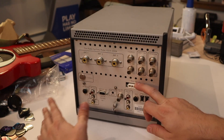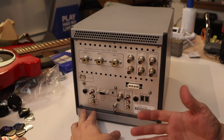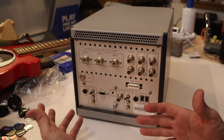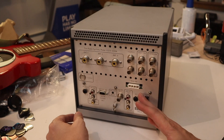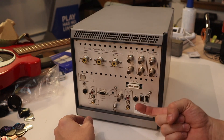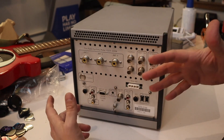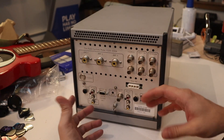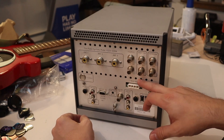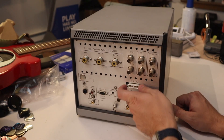As it relates to this connector, the quickest thing would be to buy a used one on eBay, but these weren't super popular — they weren't shipping hundreds of thousands of units because of how expensive they were. The connectors are not just all over the place, and there were zero on eBay when I looked. So I figured if I can get a part number off of this, I can look up a mating connector. It ended up being an AMP connector — I think it's a Tyco AMP. I thought it was Molex, which steered me in the wrong direction for a while, but no — it's an AMP connector, and I found the exact part number.